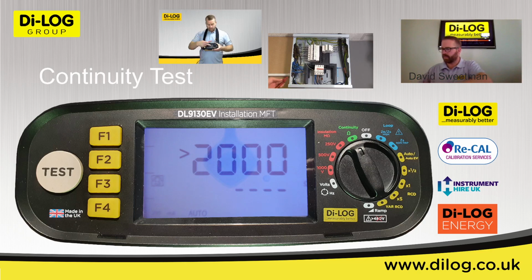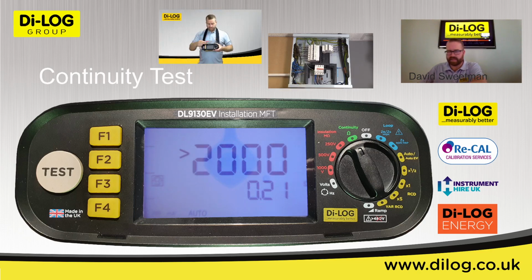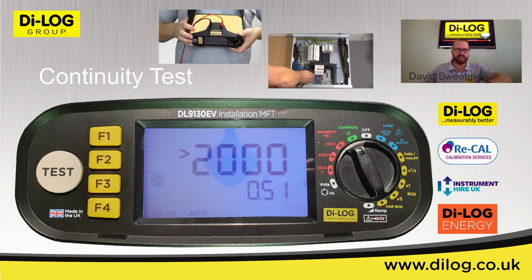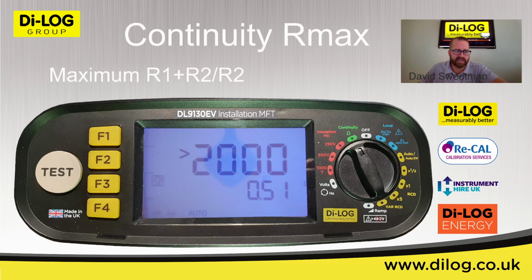So you can see I'm connecting up there, and the testers are on fully auto sensing, so the minute it sees any particular current, you can see it indicates on the screen and drops down to the second part of the display and holds it on there as well. But if you do apply voltage to any of our dead test functions, like any tester on the market, they have to indicate voltage and they'll have to inhibit any test as well. They're not the same. You can't quite hear this at the moment, but the tester does make a horrible screech to say you put voltage on me when you shouldn't have done, and the screen does actually turn red.